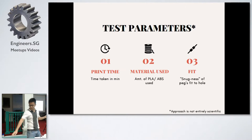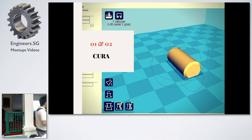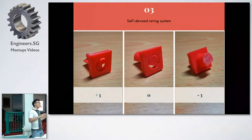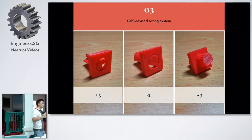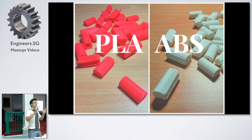I thought it was interesting because I actually try to 3D print press fit parts all the time. So I tried out the various designs he went through to see whether the octagon-with-hole really works no matter the diameter. With my highly unscientific test, I created three criteria: print time, material use, and how snug the fit is — assessed across all designs. Print time and material use were straightforward using the slicer software Cura. For fit, I had no tools to measure force, so I created an arbitrary scoring system: positive three means too tight, negative three means too loose, and zero is the best possible fit.